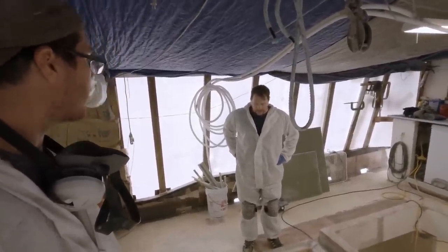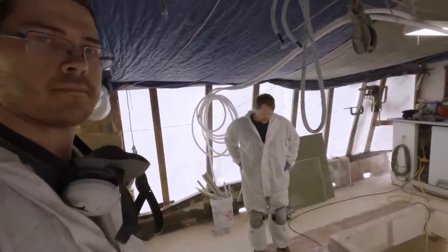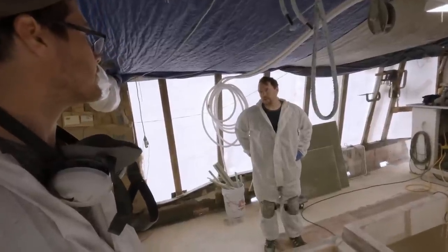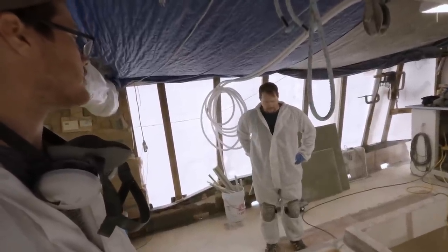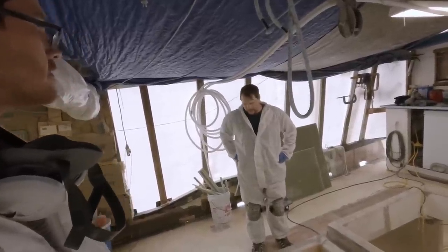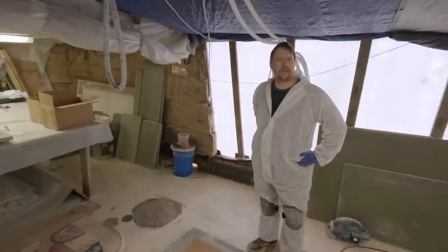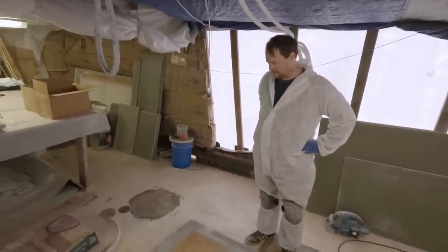So, rough calculation says it's roughly about 0.37 cubic foot. And a bag of concrete is supposed to be 0.45 cubic foot, so we'll see if one bag will do it. Should. So nothing real big for prep down there. I just marked a line to go off of that I want the level at. Put duct tape there, just so it's easy to see and easy to clean off. I don't think that I really need to go up the side with plastic or anything. Nah, it shouldn't be too messy. Sure, I'll make a big mess anyways, but it shouldn't be too bad.